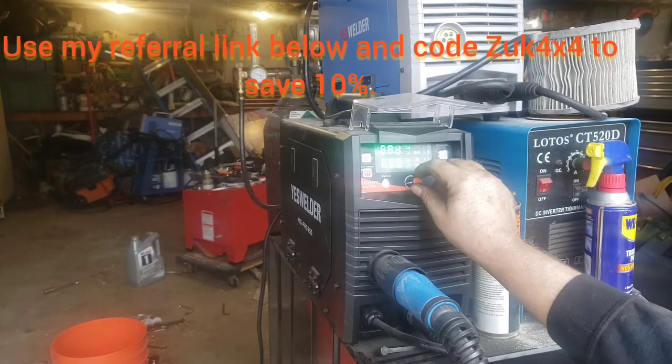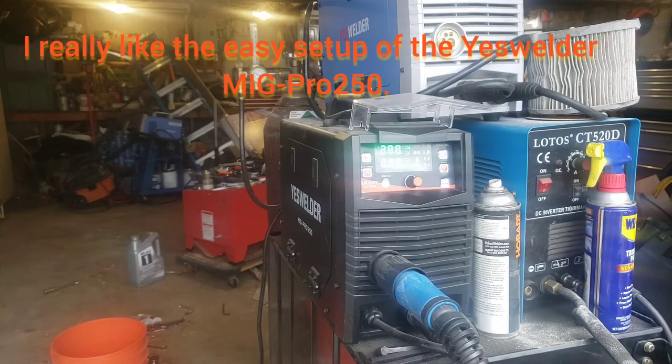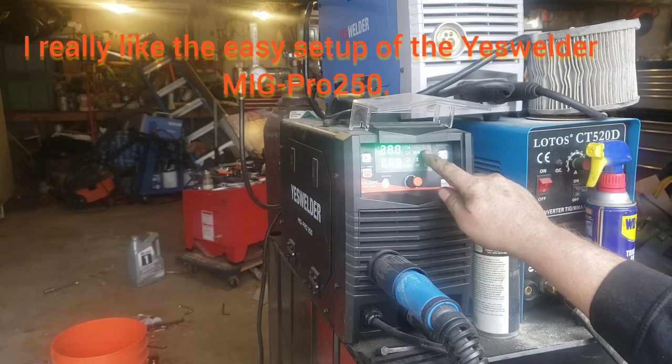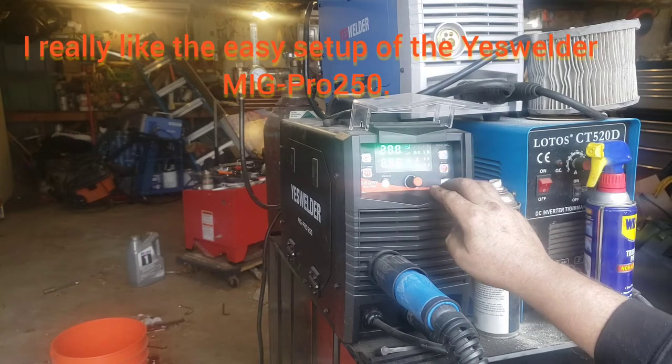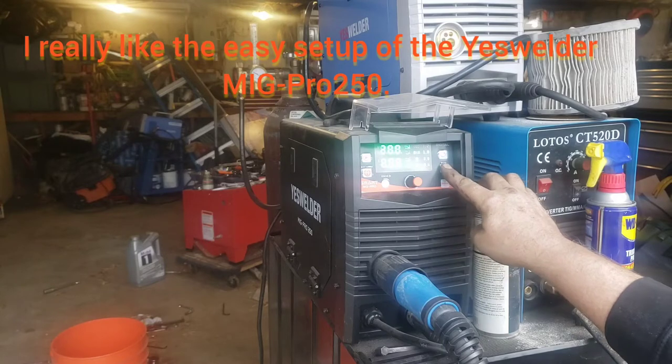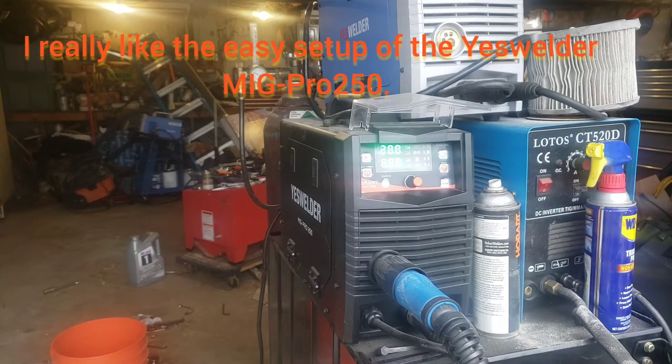Let's say it's at 5.7, we want to go to 6.6, because we're going to be welding quarter inch with .035 wire. We know it's .035 wire right there. I know that I'm on manual mode because of right there, and I'm using mixed gas. So that would be pure CO2, that's mixed. I'm not 100% sure where they've got their mix at — I'm running a 75-25, so that's pretty much what we get in the Kansas City area.